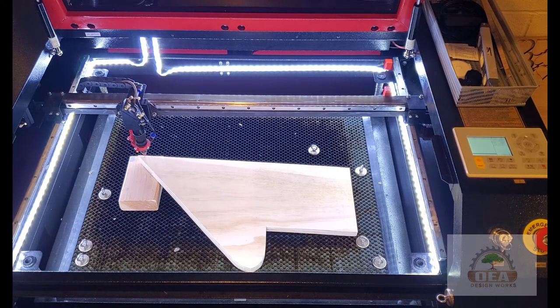I have it set up with a piece of 2x4 and a piece of three-quarter plywood. You can use whatever you want, but I recommend using something a little bit heavier like the three-quarter board. The reason is that it's not going to sag, and when you go to make your measurements you want accurate results — a stiffer piece of wood will allow you to get better accuracy.